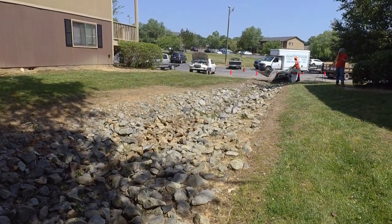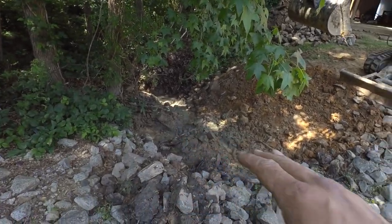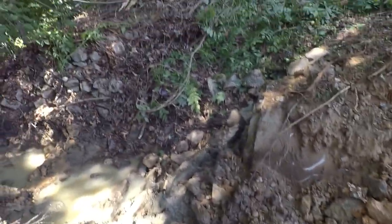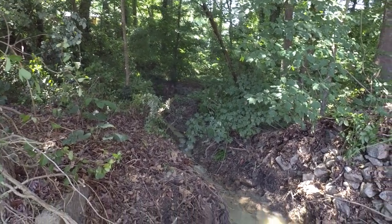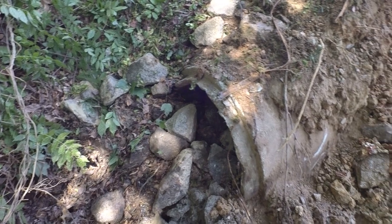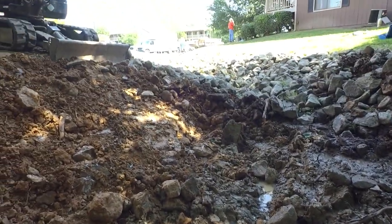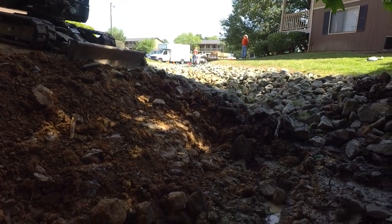The whole reason this is not flowing is because it's not falling correctly. Look at how deep we are over here. My fixed point here was pretty much the level of the creek. The creek is quite a bit lower over here and so we just dug all this out. We've also got this culvert - we've got to get this all uncovered again. But look at the fall we've got now. All we need to do is link this height over to our inlet over there and that's going to make this thing flow really well.